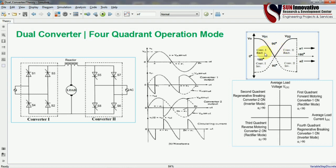When you operate the firing angle between 0 to 90 degrees, you are able to control converter 1, and at that time converter 2 operates in inversion mode. When you go beyond 90 degrees, you lose control of converter 1 since the firing angle has exceeded 90 degrees, so you have control only on the second converter, and converter 1 operates at 180 degrees — that is, in inversion mode.